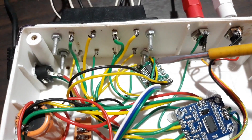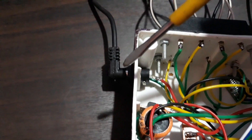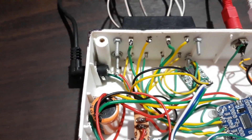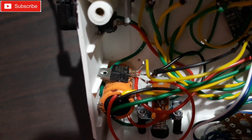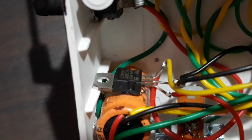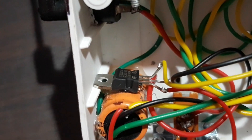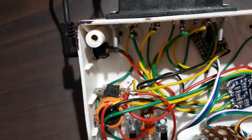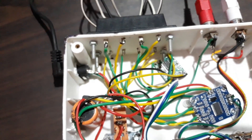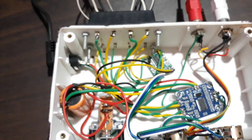This kit requires 5 volt but this one requires 12 volt. So the main power supply is a 12 volt adapter connected here. The ground is the same — the black wire. That yellow wire is connected to a 5 volt regulator IC 7805. I connected this 5 volt regulator IC to the 12 volt supply — so from 12 volt it converts the voltage to 5 volt, and from there the yellow wire carries the 5 volt output to the kit.